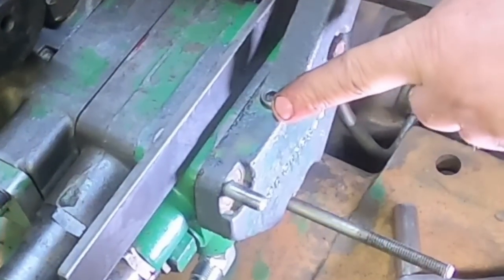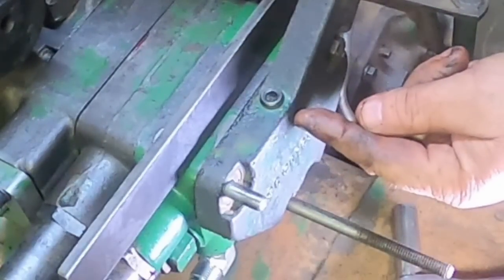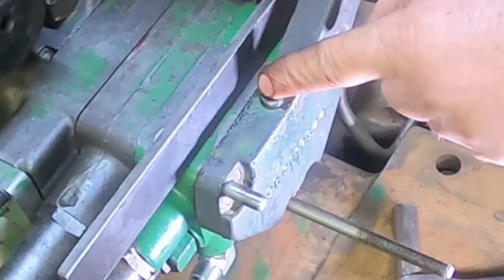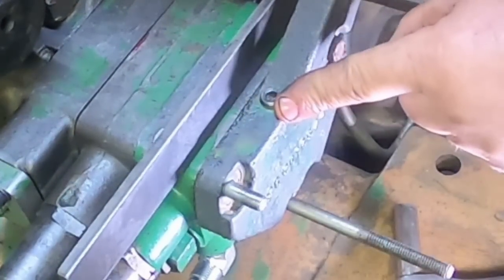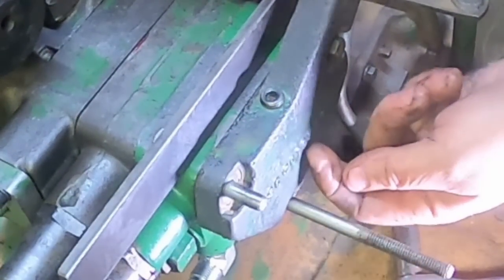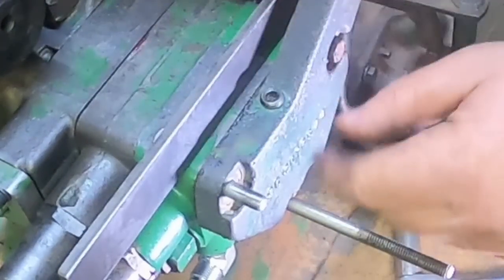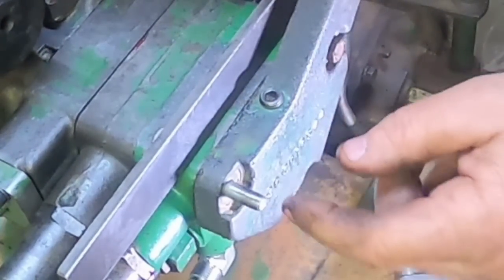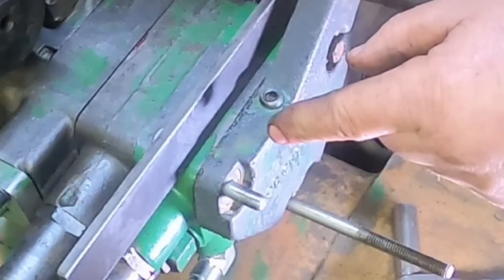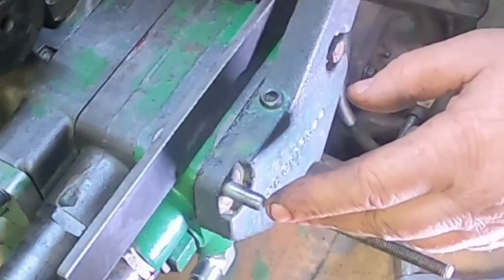Now I will say this hole here is drilled down through and connects the 2 holes that I should have pointed out before I put it on there. I have seen guys take this plug out and use it for power beyond, and it works because the oil comes through the bottom of the valve in this bottom center hole, comes up through this one, and then deadheads, and it passes through the valves only when you use them. So there is constant pressure under this, but I think that's only 1/4 inch pipe thread. It might be 3/8, but it's a small hole is the point of it.